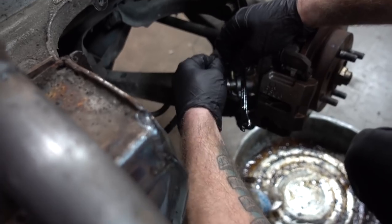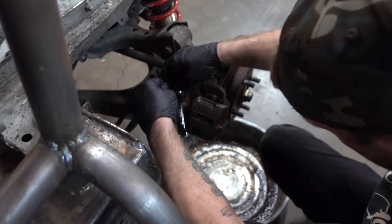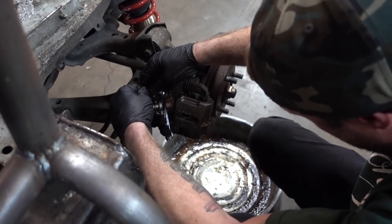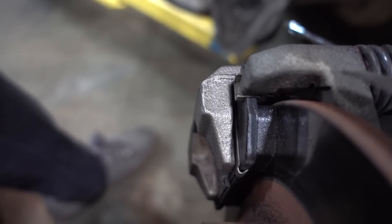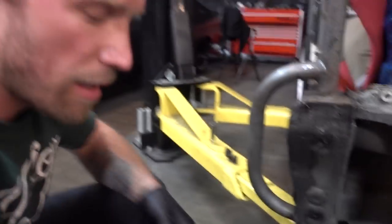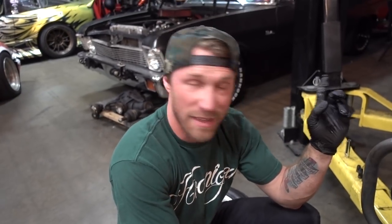So you can probably let that go. I put the hose on here because if you don't it's going to squirt everywhere. This will also make sure you get a good bleed. Give her a few pumps. She's moving. There it is — that's good! Yeah, she's going to lock up. So you work rear brakes only off the hydro? Only rear brakes. So we're going to move around to the front and bleed the front too, and that's going to be 100% front braking on just the pedal, and 100% rear braking on just the handbrake. It's not the right way to do it, but we don't care. It's going to be fun.